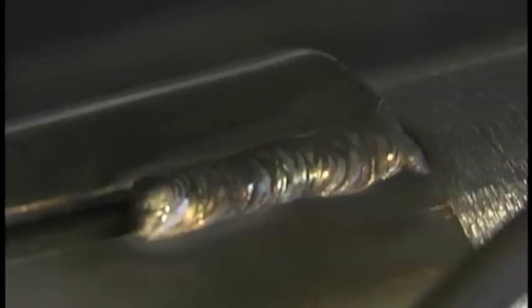When we're done with the weld I'll show you the backside so you can see what it looks like. Ideally it would fit up just a little tighter, but this is going to be okay. This is not as good as a perfect argon purge — it's not going to be silver on the backside — but in a lot of cases you don't need that silver. This is just some automotive part or a boat part or whatever. As long as it's not sugared on the backside, you'll maintain corrosion resistance and a good quality weld. You won't have a built-in defect or a place to trap bacteria like you would if it's sugared up. I'm taking this in short runs because it heats up quickly, but that big piece of aluminum tubing is drawing the heat out, so even if I let it cool for 15 or 20 seconds I can get right back in there.